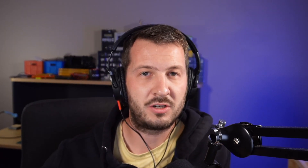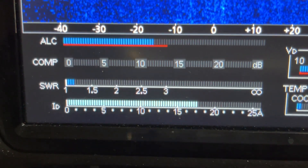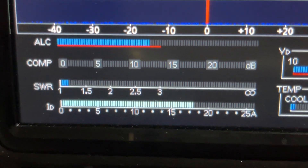Also check the fuses as well, because what can happen is that when your radio transmits, depending on how much power you're running, it can be drawing a lot of current through the cable. If those connections are dirty or you've got a bad dry solder joint, something like that, then the connections can heat up, the voltage then sags, and the radio switches itself off because the voltage is too low.